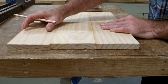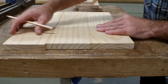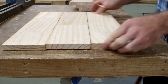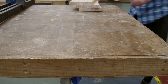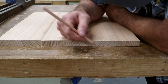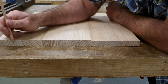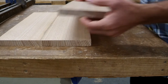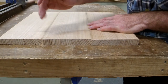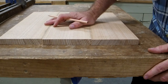I might flip one over, and because this one's relatively straight up and down, I'd actually put that one in the centre. Over time these should counteract against each other and stay nice and flat. What I do love about using ash is the grain's nearly dead straight up and down — so within reason I wouldn't have to worry too much about it with this timber. But take that into consideration every time you glue up, especially with thin-ish boards. The chunkier they are the less you have to worry. We want these nice and flat with the thickness kept.